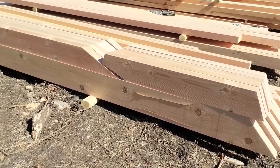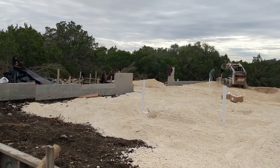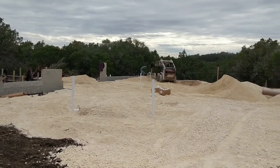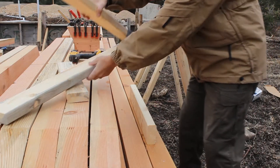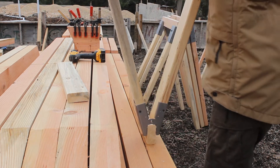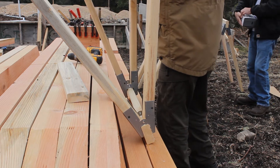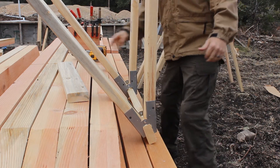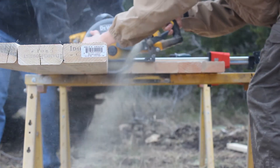After all the cutting was done, it was time to lay these things out, stick the plates on top and start marking our holes. This is where the work really started to set in because we had to lay these out accurately and flat. The foundation wasn't poured yet — the forms were still being set up. So we didn't have a large flat work surface. I couldn't afford to wait until the slab was done, so we came up with the next best option: we built a whole bunch of sawhorses. Then we found our next problem — sawhorses on dirt full of rocks like to sink and get bumped around, so we had to take some two by fours, scab onto the sides, draw a string line with a bubble level, and level up the tops of all those two by fours.